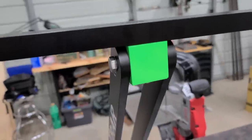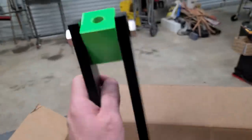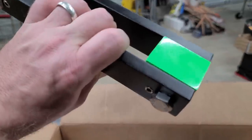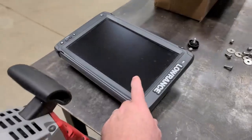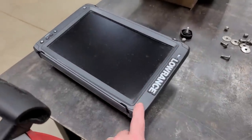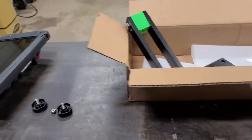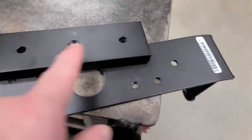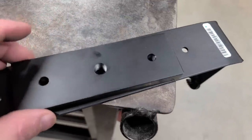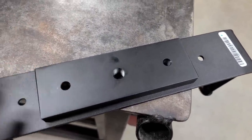I really like this rod rack — it's about 10 times nicer than the DIY I did. But enough time on the rod rack; we've got to go mount my depth finder holder, which is also going to match my decal. What I'm mounting is a Lowrance Elite 12 that I already had but didn't have a mount for yet. The holes on the Lowrance bracket aren't lining up, so I'm going to line this block up and drill some new holes in it.